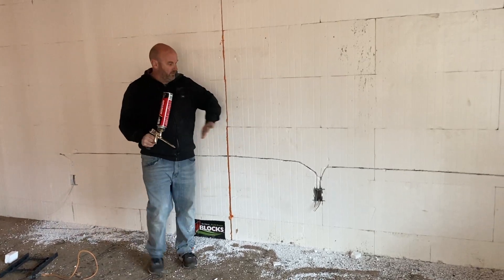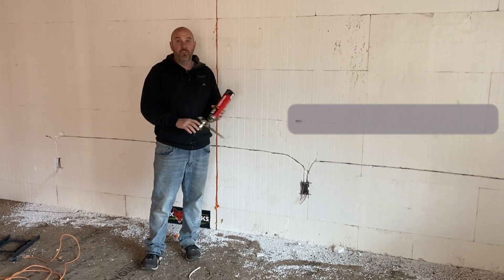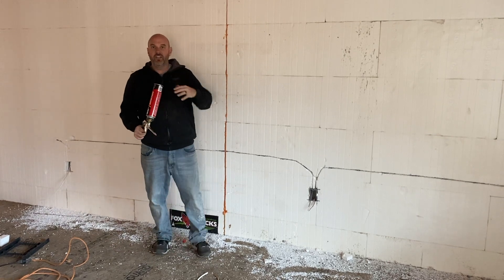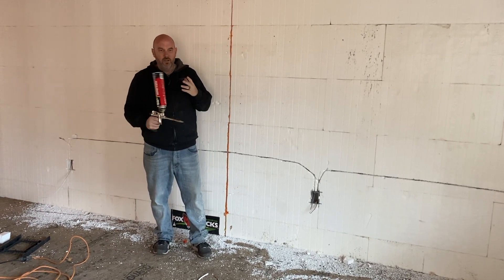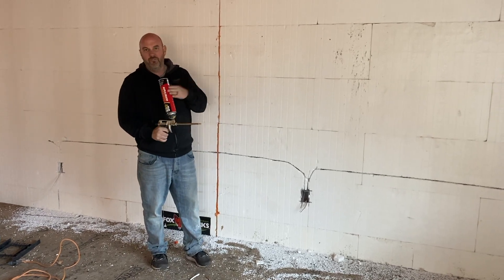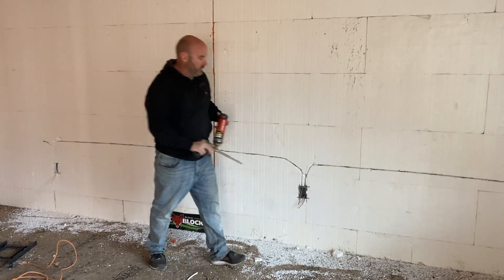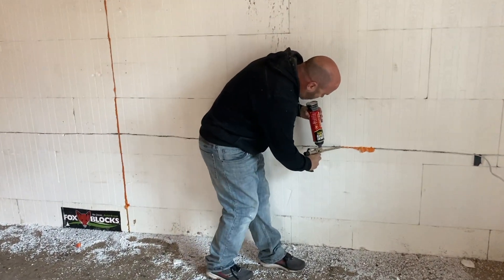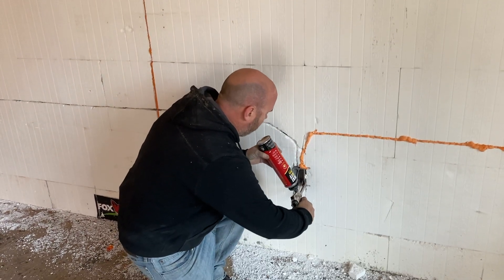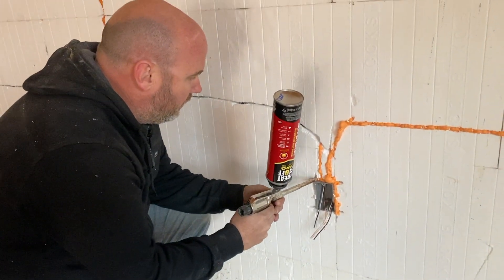The last phase of securing wire or PEX pipe going for your plumbing — anything like that — is foaming everything in. This will be your best friend when you're doing ICF, whether it be your joints where the layout comes together. You foam everything, you seal it up, no concrete leaks out while you're pouring. Around your windows, you can really tighten up a house with one of these. If you buy the disposable cans for like five bucks at Home Depot — these are about fifteen — but you can turn them off, so you get every drop of it. They're way better value than the ones you have to use up in five minutes or they go bad. So we're just going to come over here and go all the way around.